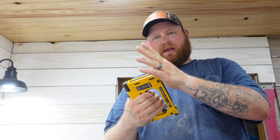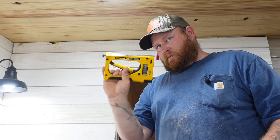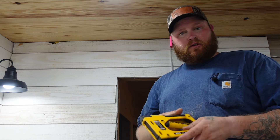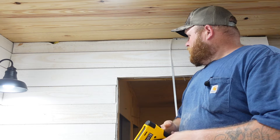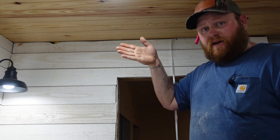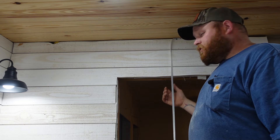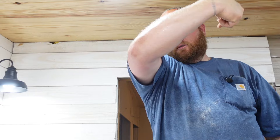What I'm using is picture frame push pins — it's a staple gun where the pins come out and it's actually pins for picture framing, not staples. I did some picture framing in my earlier years so I own one of these. If not, you could use peel-and-stick LEDs, super glue, or a regular staple gun. I'm going to take my LED light strip and put it so it's a half inch this way — not the other way — because you want your LEDs facing out towards your ceiling.